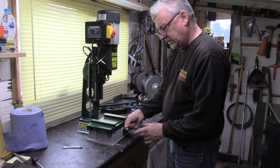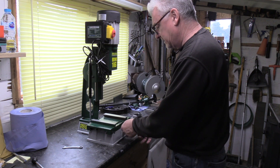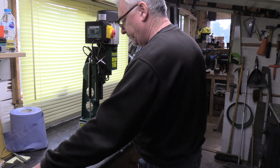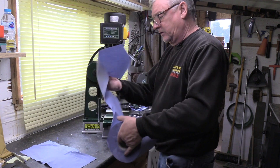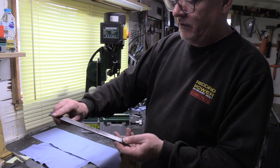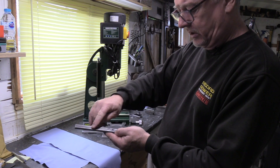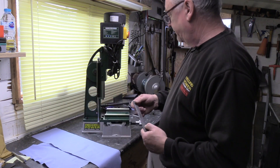I can strip it out and show you how the table comes off. This face has already been done, so take care of that when you go to do your work on the next one. Get it round - maybe put some protection down so you don't pick any muck up. Now that comes out easy. The running face again is shiny, and then you've got the actual dimple position for your grub screw to go in - that's locating it. And you've got two little marks on there which is where the other grub screws are just locating and pushing over.